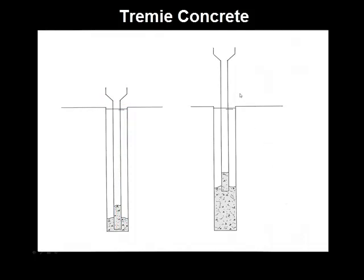After a period of time, you have to begin removing sections of tremie pipe. The concrete will begin to set and you need to get the tremie pipe out as you advance the work. You calculate how far one or two concrete trucks will go, and determine at what point you want to begin lifting out the tube. You continuously lift out sections of the tremie pipe, always keeping in mind that when you reinstall the tremie pipe, the tip of the pipe has to be below the level of the concrete, so that you're always placing concrete into concrete and displacing the slurry.